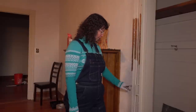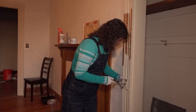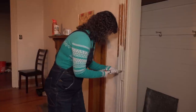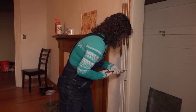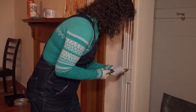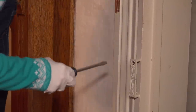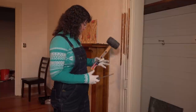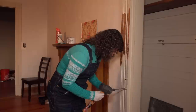For Mike to start stripping the paint off the door frame, we want to get this door latch off first - it is beautiful and ornate. We have one method of trying to get this little screw out. This works really well with slotted screws but not so much with Phillips head. We're going to put the tool in there, tap it, and see if we can get some of that paint out so we can get a better grip on it.